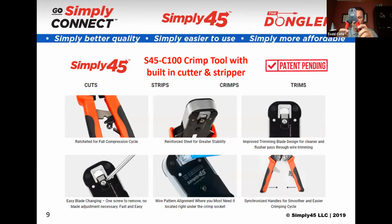But what's nice about our tool, first of all, is that most conventional tools out there, pretty much everyone that I've seen, have one handle that is fixed and the other handle that does all the work, like this, right? What that does is it takes a lot of hand force because it's only coming from one side, but it also puts a pivot on the crimping die. And it's in microseconds, right? Pin 1 hits pin 8 before it actually engages all conductors at the same time. And that's where you could get where it slips on pins, or it missed a pin or whatever, right? So what we did is we developed a true vertical crimp, where our crimp die goes straight into the contacts of the connector at the exact same time.